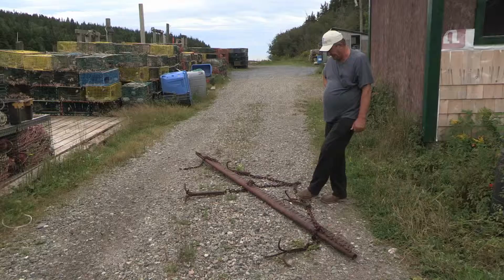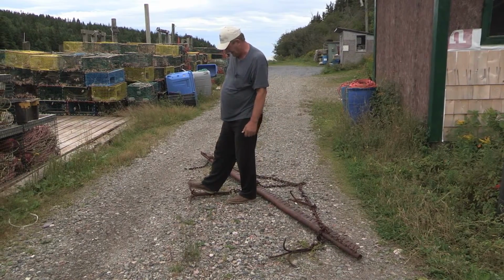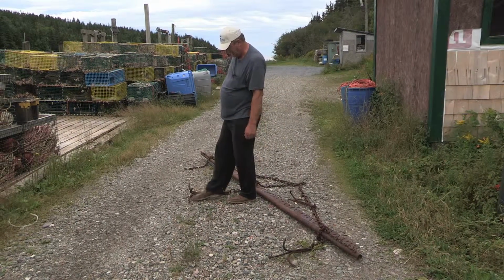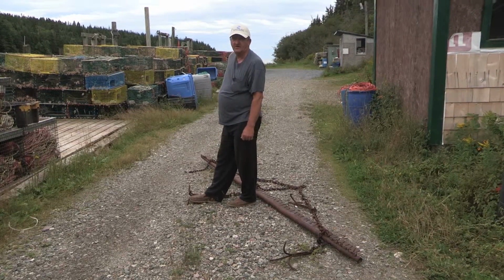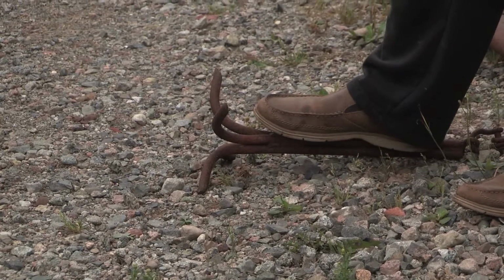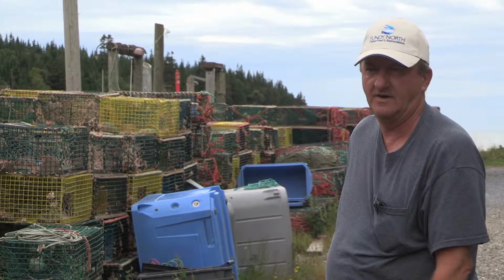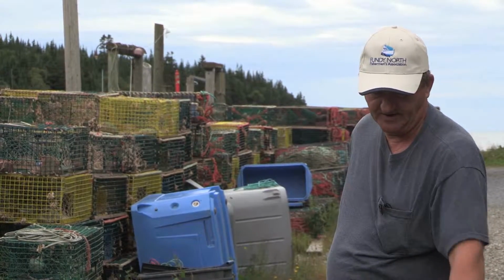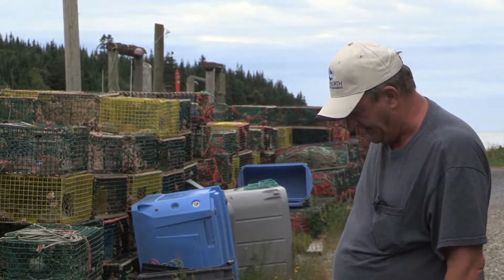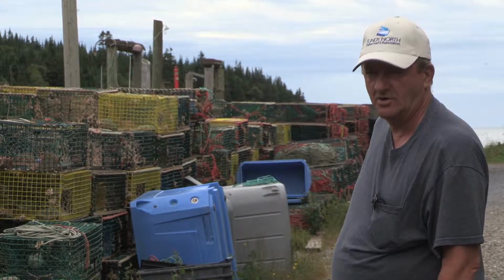Well, if they're made of anything larger than 1/2 inch than these, you see how they're bent. Some of them are straightened right out. If you make them any heavier than that and get caught, they won't straighten out. If you're hooked behind a rock, you lose your grapple because you'll part your 1/2 inch rope before that'll bend that steel. So if you make them light enough, those sizes are the best. Any heavier than 1/2 inch and you're looking for trouble, and then you'll lose your grapple.